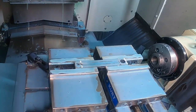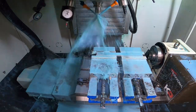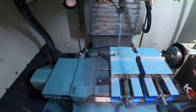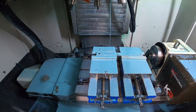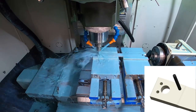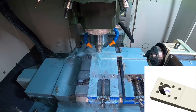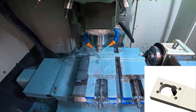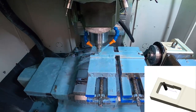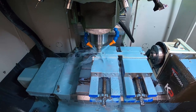Now the fluting process will be repeated on the other side off camera. Now we'll take a look at the main rod - process is pretty much the same. First pre-drilling the bearing locations. A half inch end mill will open up a bigger starting area for the slot on this end and then we'll bore the hole on the other side. A 5/32nds drill is used to pre-drill the corners of the pocket on the main bearing end to reduce chatter with the finishing end mill. The 2D adaptive tool path is used to rough out the pocket and then a 3/16th end mill will finish the pocket. A 5/32nds end mill is run around the profile to clean everything the 3/16th end mill may have missed.